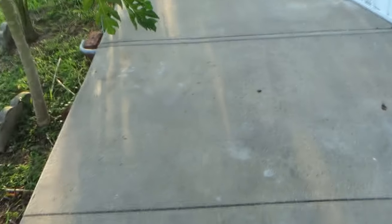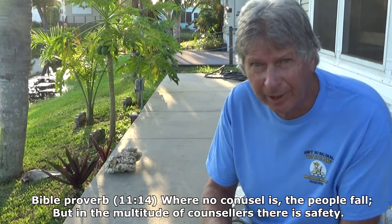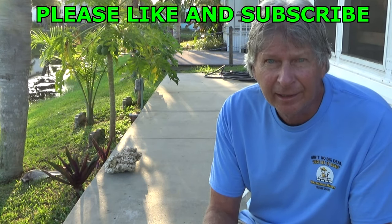This is a couple weeks later, and there it is. I didn't even have to put mud over it to match it. When doing a job like that, especially in Florida, I only mixed it one part Portland to three parts sand, added the water, and mixed it thoroughly. It's what they call a swimming pool mix — all the water is inside it, and they tap it in. It doesn't dirty up the sidewalk and matches right in there pretty good. A lot of stonemasons used it in Europe for stonework. You mix it and it doesn't leave marks around it. That's it — thanks for watching, I'm Mike Haddock, see you next video.